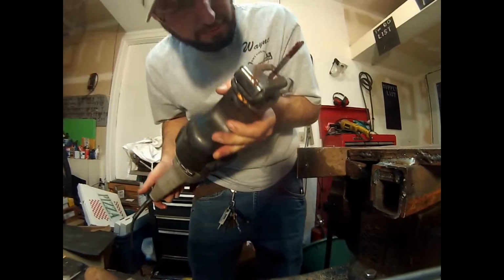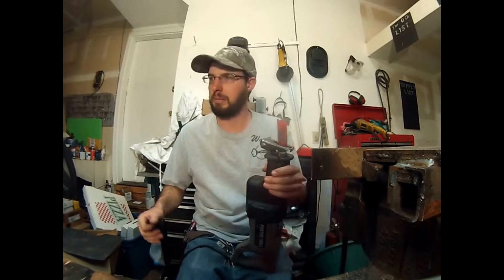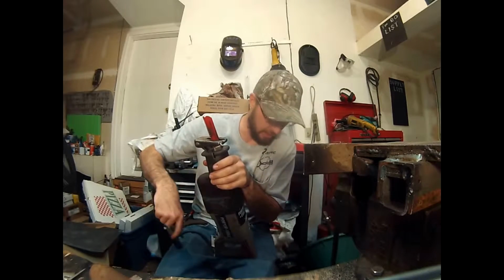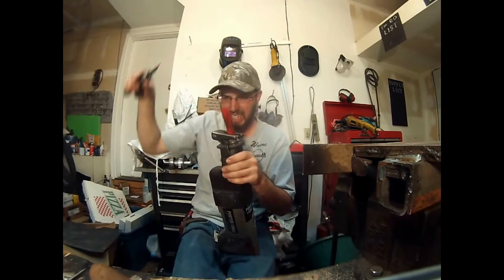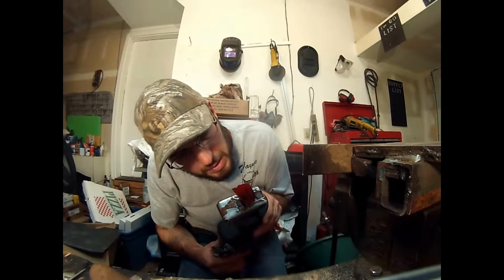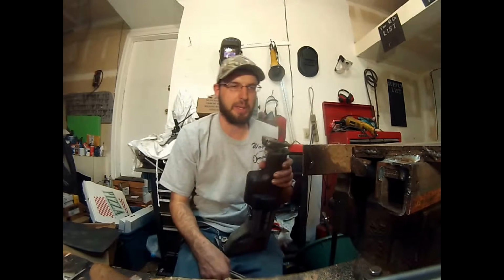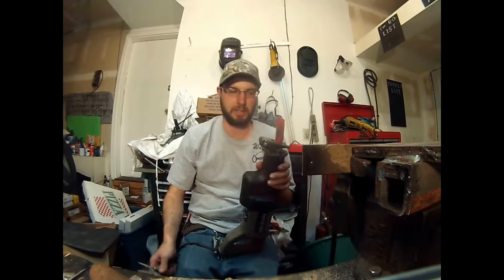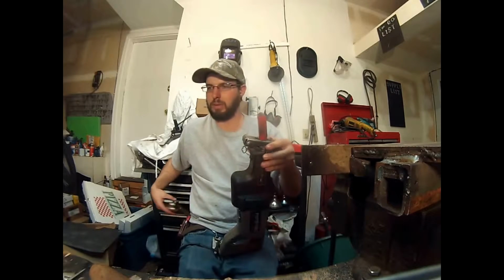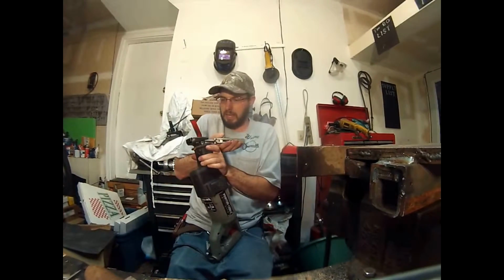Okay, so very cool stuff. It's a little hard to tell if we had some chipping just because of the lubrication we put on there. It's kind of gumming things up to see, but it looks like one, two, three, nope, just one, two. It looks like we had 2 teeth chip cutting through this leaf spring steel. That's great. I mean, any of these other regular steel blades are just going to completely get toasted doing something like that.